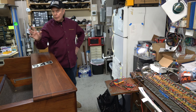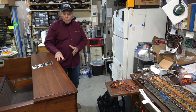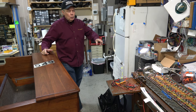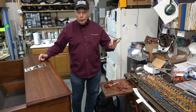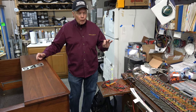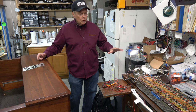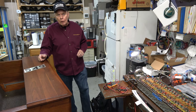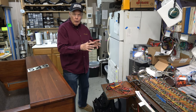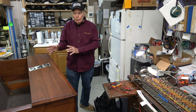We're not sure which state, but it was definitely Amish craftsmen. We have all the rest of the wooden parts, and right now we have the entire set of parts that are going to be installed into this wooden case. The tone generator, which I'm pointing out right now, has been recapped and modified to factory specifications. There were some alterations and upgrades that the factory recommended.